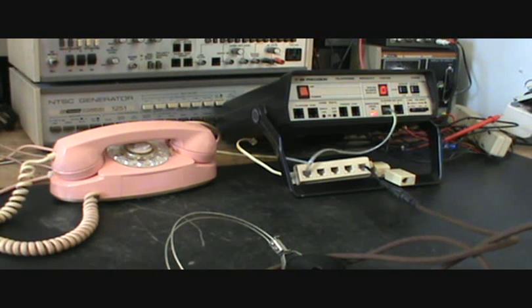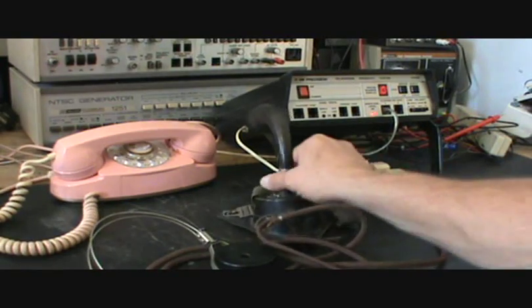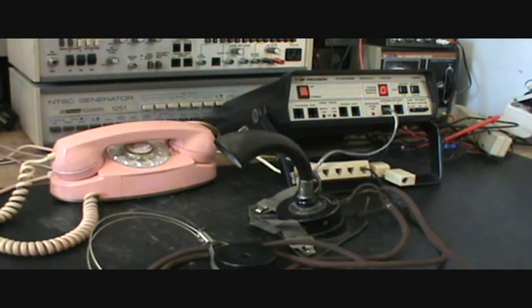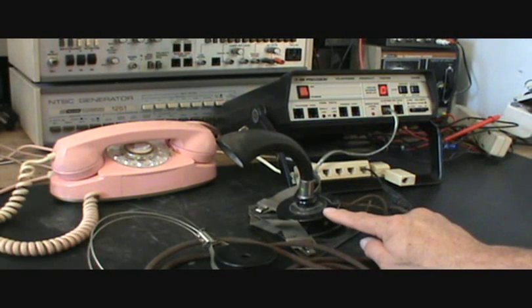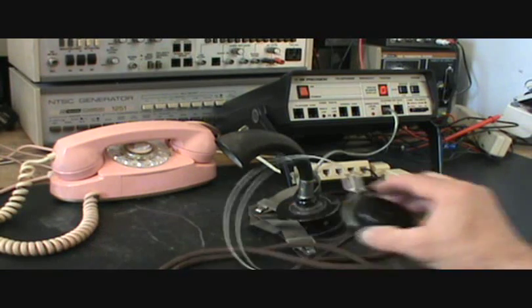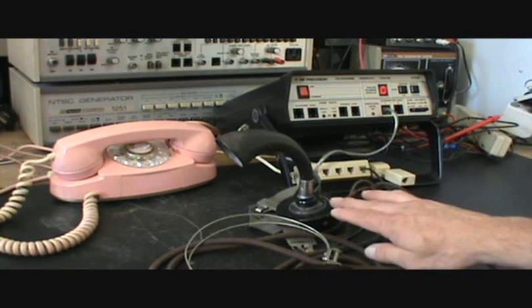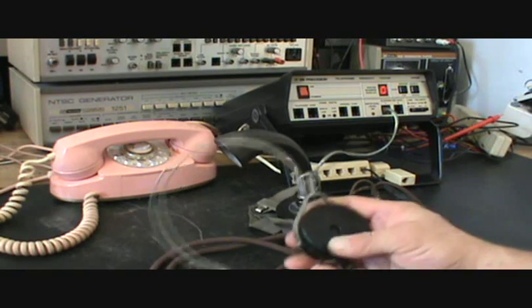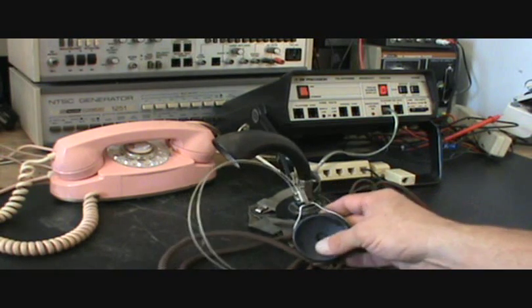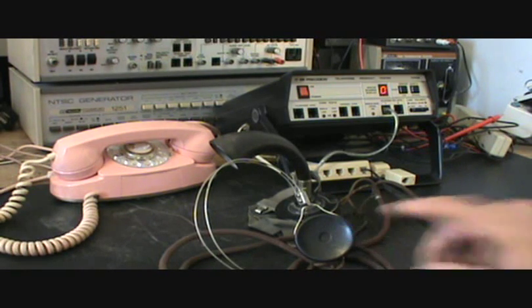And if you talk to somebody on this, are you going to sound a little different? I guess you probably would — you're talking through a horn. You're talking into a transmitter of the old style where it's got a diaphragm with a needle on it that's bouncing around. So that was the older style type transmitter. And then you have the older style receiver capsule that we showed you earlier, and basically that's a diaphragm also.